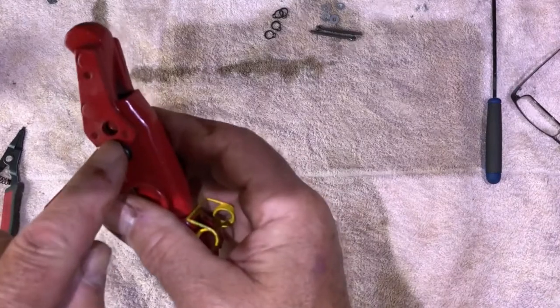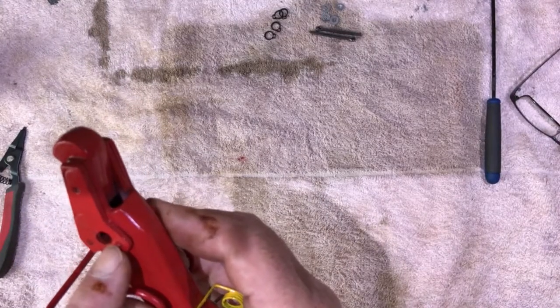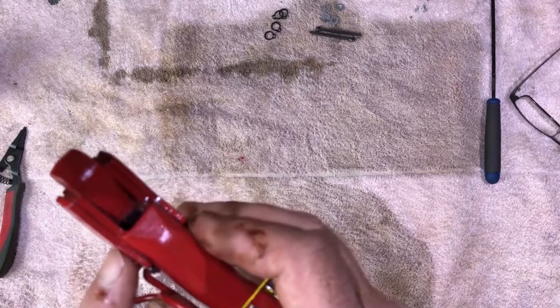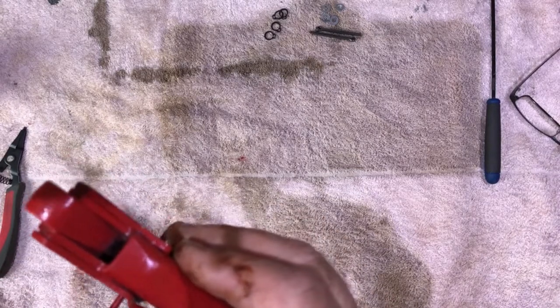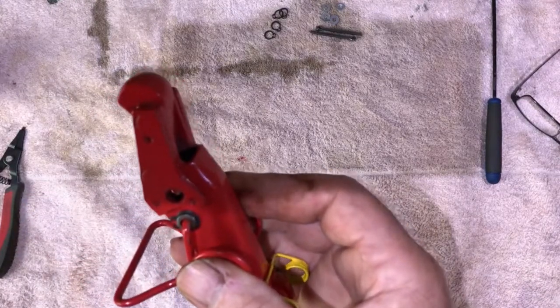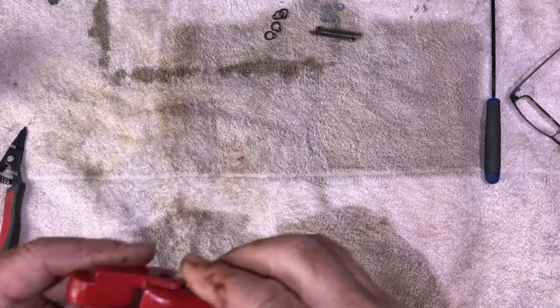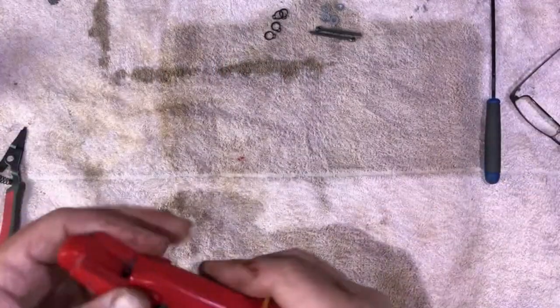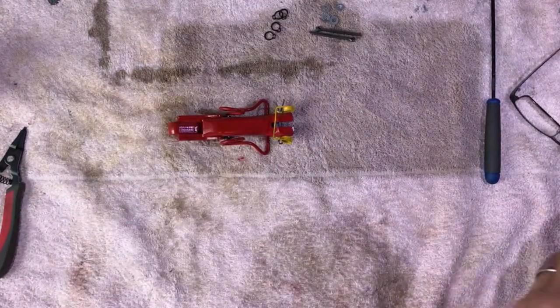I still need, there's a pin. We need to make three pins for here. Remember, we've got the steel, but I've got three pins to make, drill the holes in for the little split pins to go through to fasten this to the pressure plate. And I need to find something to do about this shatter here. There's a shatter here. So there we go. That's the fingers done. Let's crack on. I'll come back to you when I finish the three. All right, not be long.